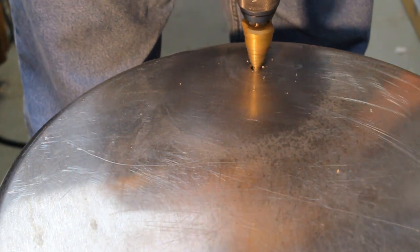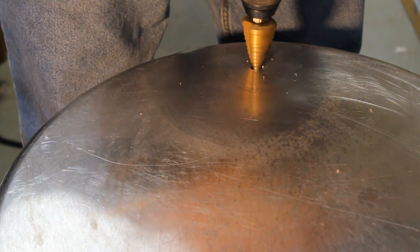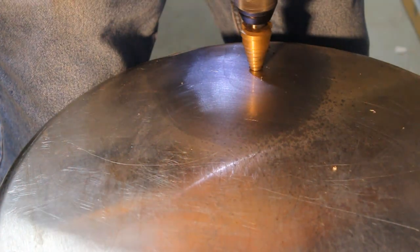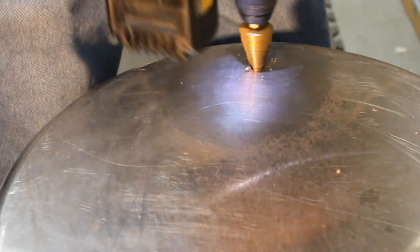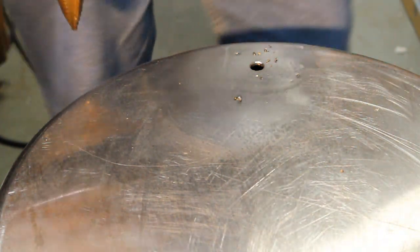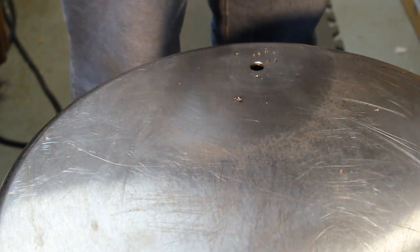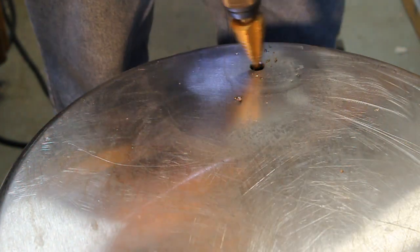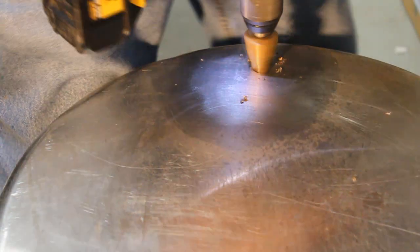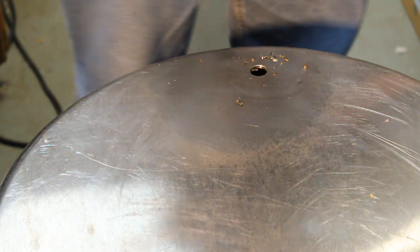When we say high pressure, low speed — I'm putting all of my weight down on this drill, and the drill is on its lowest speed and highest torque setting. You want to make sure that the bit doesn't get too hot. You can keep spraying it down with WD-40 to keep that cutting edge in check. You can see the WD-40 is smoking a little bit.